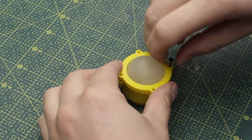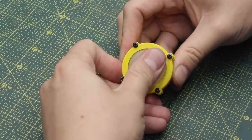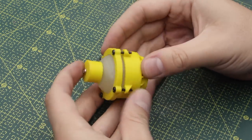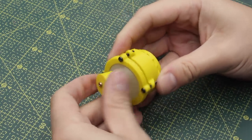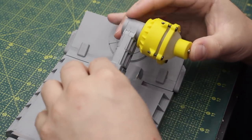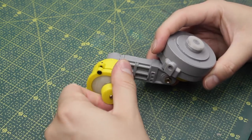I was trying to come up with a design that didn't use bolts to add tension to the system, but I feel like this is not important. I can use some nice tiny M2 bolts at the end of the process that look interesting and don't affect the overall look of the robot. The four bolts pull the pressure ring towards the ball, and that adds pressure to the system so the ball can keep its position. I'm super happy with this ball joint design — it was my first try at making something as complex as this, and it works super well and also looks super interesting. At the end of that work day I was super excited, I attached it to the intermediate leg piece, and I was super happy with what I was seeing.